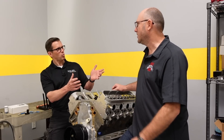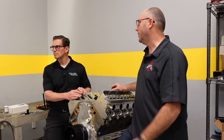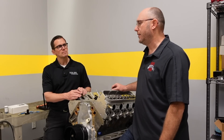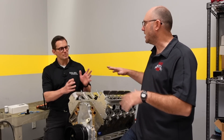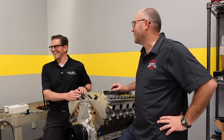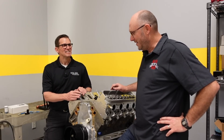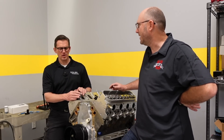The pulley swap was literally 200 horsepower — literally on the first full pull. Then we tuned and tweaked a little bit, added some fuel, took some away, made timing changes. And 1,317 was the final number, which is pretty impressive for just a little 393 cubic inch LS.